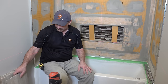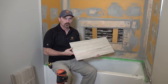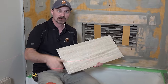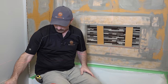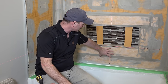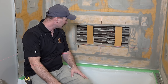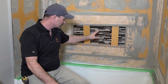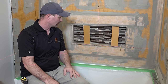In this case, the majority of the tiles are going to be these 12x24s, and I'm just going to stagger them at a half-tile stagger. I went ahead and figured out how I best wanted to set that up. We're going to start with a full tile centered on the back wall — we're doing the back wall first — and then in the next row, it'll go back and forth from there.